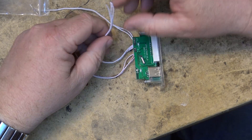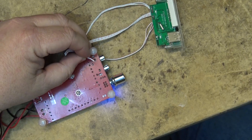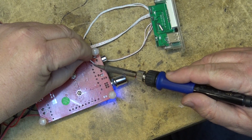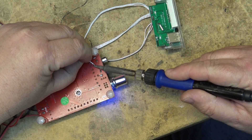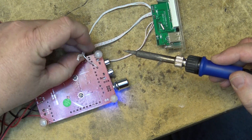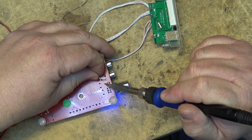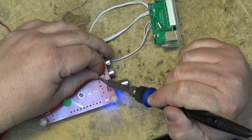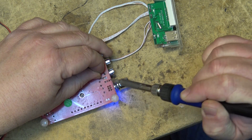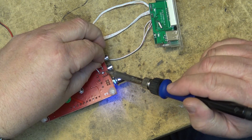It comes with a little remote control, so let's hook this thing up and see what it does. I'm just going to tack this down to my little Class D amplifier — we'll use this as our test amp. I'm going to solder it right down to the input terminals for the line input, and the ground is this one here.